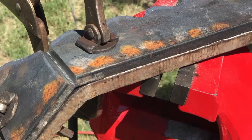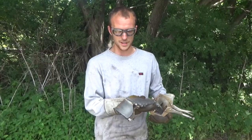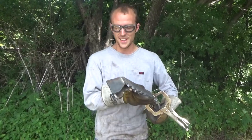Once I'd scored it almost all the way through, just a few taps of the hammer and it's bent. Ran like two passes of thin 7018 up the side and we have a completely functional step in maybe 10 minutes. That's your random little tip of the day, brought to you by myself — Welding in the Sticks.